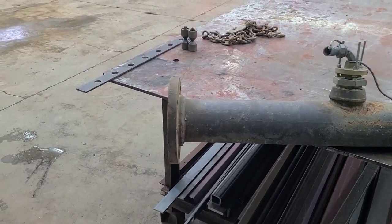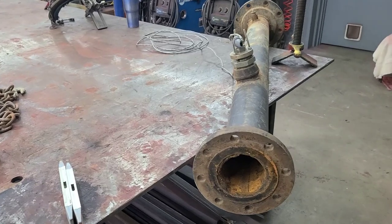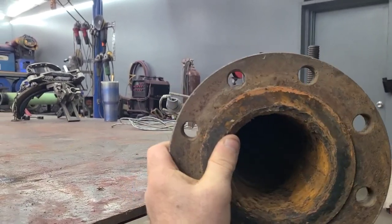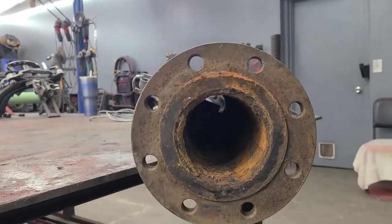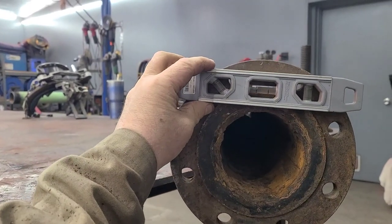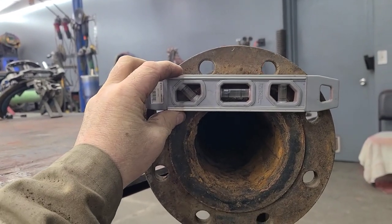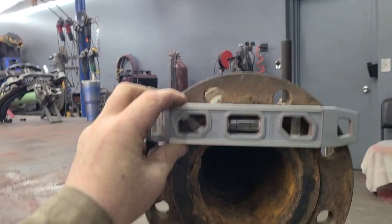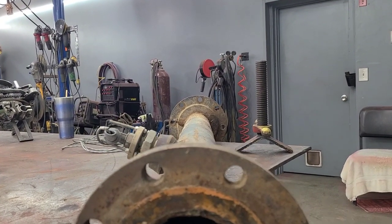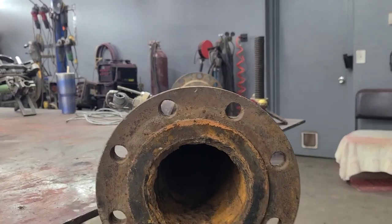Another thing we want to consider is how these flanges are turned. On new pipe fabrications, what you should always strive for with regards to how your flanges are positioned is what's called two-hole level. When flanges are two-hole level, you could take two holes like this, and those would be level. And the two holes on any other flange on this pipe should also be level. If we look at this assembly, the way it's made, it is not two-holed. So let's look at two-holing for a second.